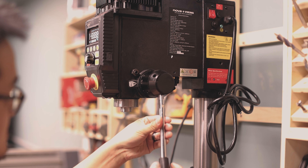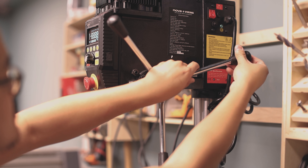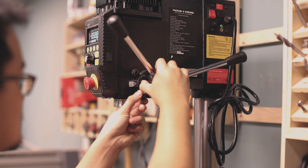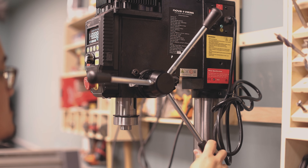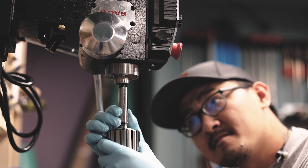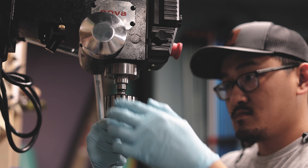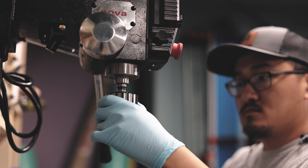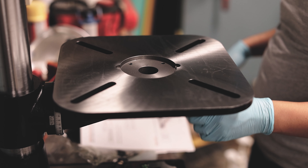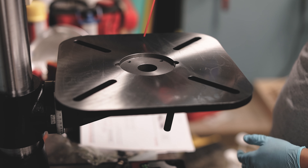Pretty much the heavy lifting is done. Everything else should be pretty simple. The drill press handles simply just screw into the pinion shaft, and with the provided wrench you can go ahead and tighten it down. When installing the chuck, you want to make sure that the arbor is facing the right way. There's a little tongue at the very top and you want to make sure that's in the right direction. With a few sharp taps with the rubber mallet, the arbor should stay inside the quill. The table is really easy to install — it just slides into the table arm and then you'll use the handle at the bottom to lock it in place. I'll go ahead and clean it with WD-40 as well.